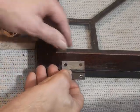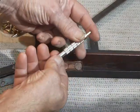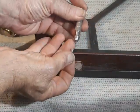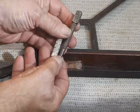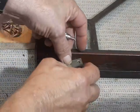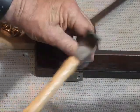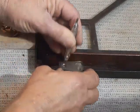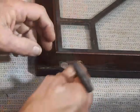To help install the hinges, I have a special tool. This is a Stanley 1109, and it is supposed to be a nail set for particularly small nails or brads. Why anybody would need a spring-loaded nail set I really can't say. What I find it useful for is I can put it right here on the hinge and get the screw hole perfectly centered. It makes it much easier to install the hinges, because if you get the screw off just a little bit, it'll pull the hinge one way or the other.